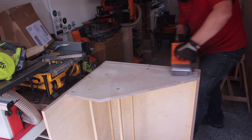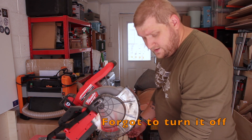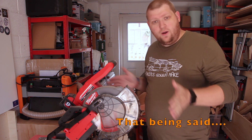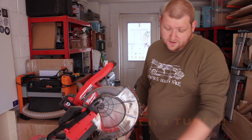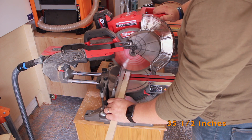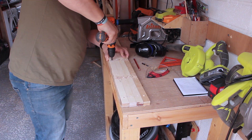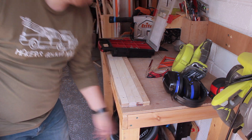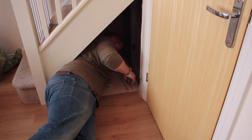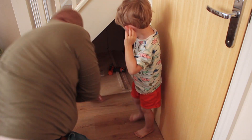I've got these 25mm strips that I've cut — these are going to act as runners for the wheels because I can't have them wobbling and jiggling around, and it will help easily guide the rack back into position. I cut them on the track saw to a length of 900mm and then put holes periodically through them. I wasn't really measuring exactly where the holes went — I just placed them where I felt they needed to be. I tried this before with 12mm ply nailed to the floor but they kept getting knocked off, so using 18mm ply and making it a bit thicker should hold and guide the wheels nicely. It's important to get help when you can.